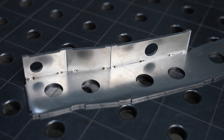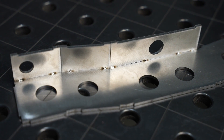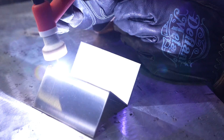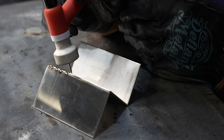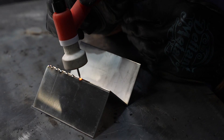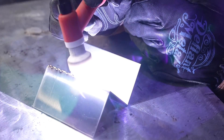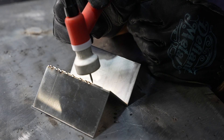It makes consistent, repeatable tack welds that are the same every time, with minimal heat input. The less heat that goes into your tack, the less it's going to pull and the straighter your part will be when you go to weld it out. Here I'm on some 16 gauge stainless steel on an outside corner joint — pretty common for making pans or kitchen stainless work.